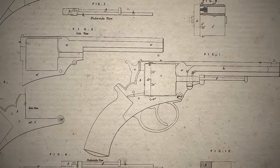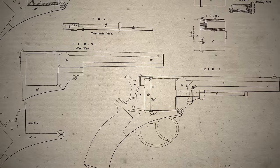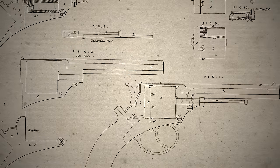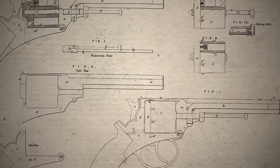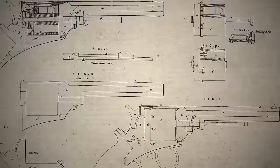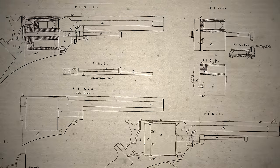It's also worth noting, his two-piece frame was modified slightly. Now the cylinder is fully enclosed with no opening at the bottom. Instead, the grip section, along with the trigger group, is attached separately. This is very much like the modern AR upper and lower receiver. It's worth mentioning that he hedged his bets by making the design capable of being breech loading or muzzle loading. This was a real concern at the time, as metallic cartridge breech loading wasn't entirely ironed out yet.